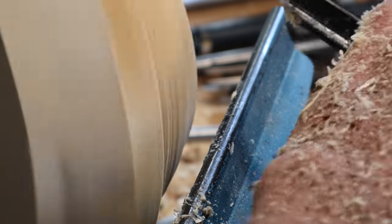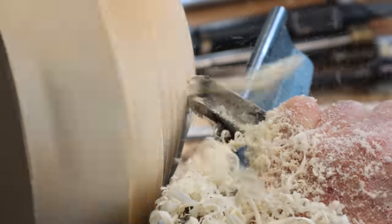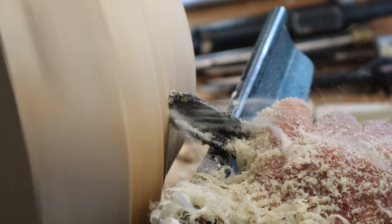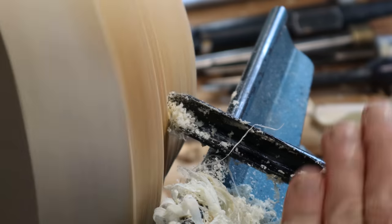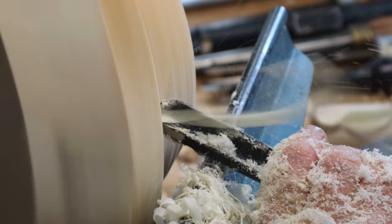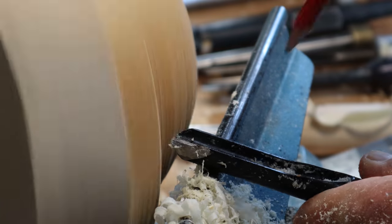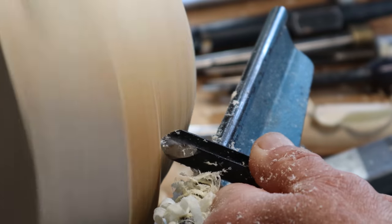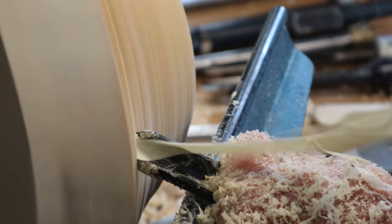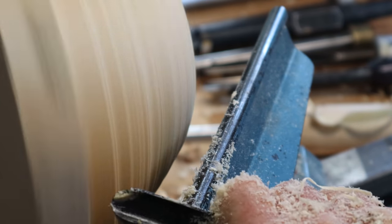The difference between cutting here where you'll just drag the wood off eventually, and just pivoting the tool round slightly — you can see how much more wood you take off with a slight change in angle. If the flute is fairly steep it won't cut very much, whereas if you roll it round just a little bit it's going to be much wider. If you roll it right round then the wood's going to bear down on an unsupported edge and that'll catch. Somewhere in the middle, you'll need to rotate the tool slightly to pick up the best shaving.